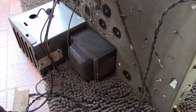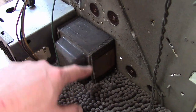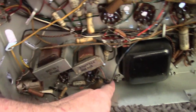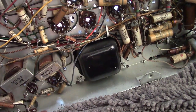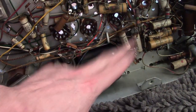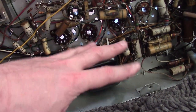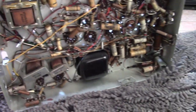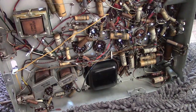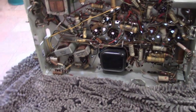Taking them out can be a little challenging. I haven't seen one quite mounted like this — it looks like there is a U-bolt that runs through the cores around, and then there must be four nuts underneath. You can see one of them down here. All the wires come out here — there's going to be two for the primary, a 5-volt winding just for the 5U4 rectifier, three for the secondary with a center tap and the two outer windings, and then the 6.3-volt filament. Sometimes it's a second filament winding just for the picture tube, damper tube, or tuner tubes, but in this case I think they're all in parallel.